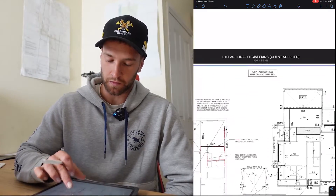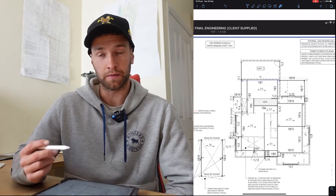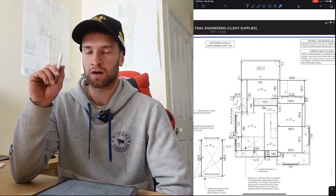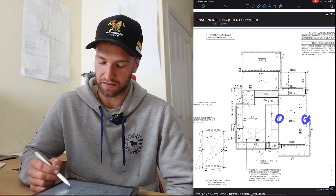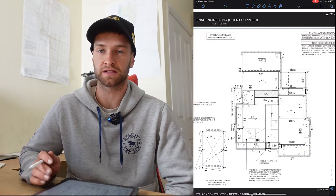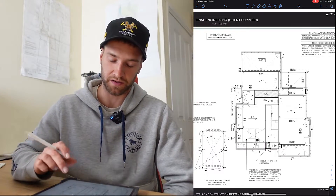The only other thing to look out for is your engineering. You've always got a beam under your external upper walls, and beams always land on something. This is the reason I mark out the upper story onto the ground floor — when I'm marking my plates I can put in the triple studs under all the beams, or a steel column, and know they're exactly right because I've checked the upper story for square. Then when I come to doing beams it's just throwing it straight up.